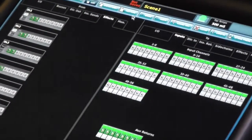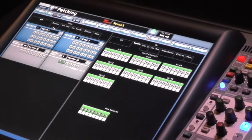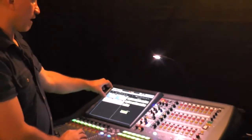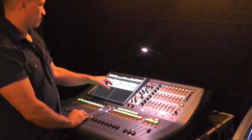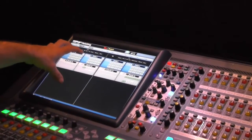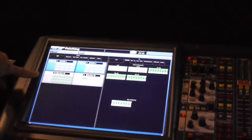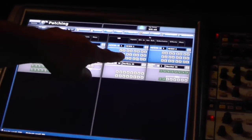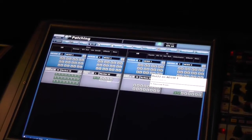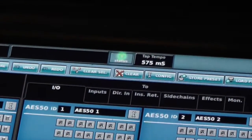We have 48 channels of communication on each side — a 48-channel stream between the two consoles that we can use however we want. We can send from our I/O on this console or from the surface I/O down an AES50 stream to the other console. If we had a DL251 plugged in, we can send it down those streams as well. We could also take the surface I/O on this side and bus it back to the other console. Now they've become one unit — through this Cat5 stream we have 48 channels of bi-directional communication, clocked properly and working in sync.